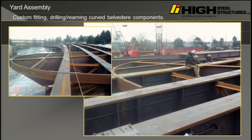Now, what's interesting, I'm glad we did, because this girder's bearing stiffener, because of the skew of the bridge, the incline of the bearing stiffener is towards you, the end kick, because it has to be truly vertical after all deflections have taken place. Its neighbors all tilt away from you. Well, our fabricators were actually building these guys first, and then they got to this one last and said, that's a detail error. So they took it upon themselves to weld, full pen by the way, full pen weld the stiffener in what they thought was the right position. So we're glad we caught that, because when we assembled it, we would have had to do that twice. And it's a lot less costly to fix that at your shop than in the field.